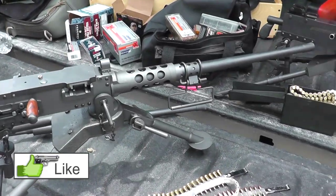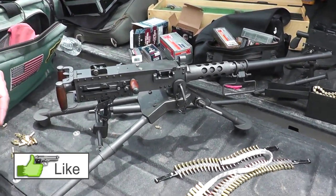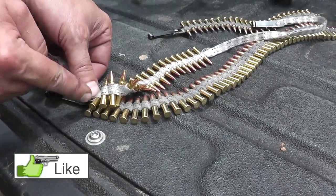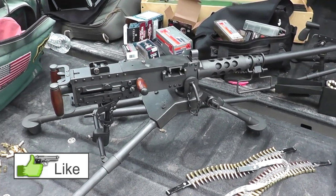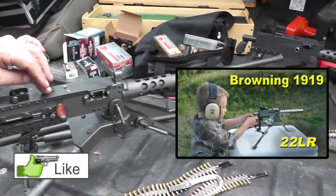This will shoot both calibers just by switching out the barrel, because the breech face and everything else is the same. The .17 HMR case is based off the .22 Mag case, so they're the same at the back — it's only the front where it's necked down. All you have to do is change the barrel; the rest of the recoil system is set up to run either caliber. It operates pretty similar to the smaller one we did the video on last time.